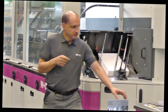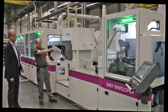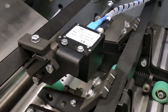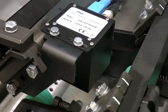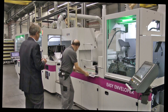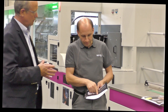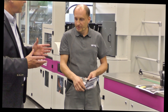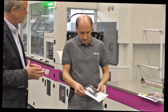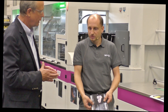One camera scans a code printed on the outside of the envelope, and the camera in the delivery section — located right in front of the bottom top folding cylinder — scans the code of each envelope which goes onto the delivery table. This code is ideally located on the bottom flap, so it's covered by the seal flap. It could be anywhere around the envelope surface, but ideally on the bottom fold on the leading edge, so it's covered and nobody can see it.